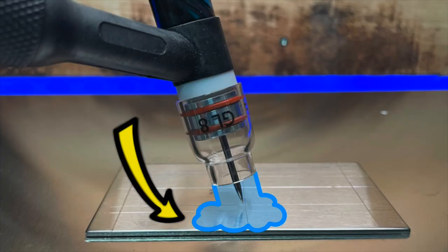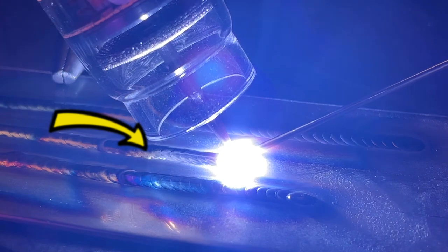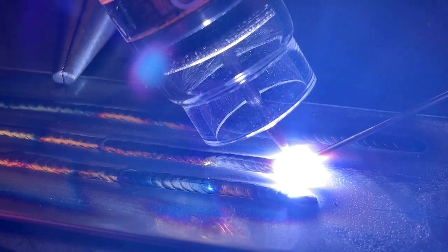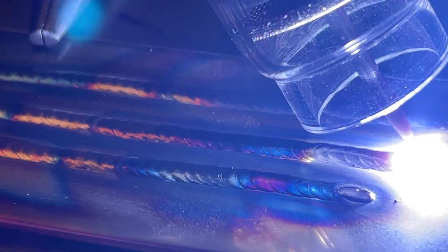There's going to be a fine line to walk with this. As I'm welding and controlling the heat affected zone just behind the trailing gas, that little area is going to have a slight reaction with the atmosphere, causing a light oxide — which gives us colors. It does so a little better than it would with a bigger cup, so as I move away from this area, we get better colors. Take a look at this footage — we can actually see the light oxide forming on the trailing area, and on the back edge where the trailing gas falls a little short, we can see the oxide forming right away, creeping along and following us perfectly as we move.